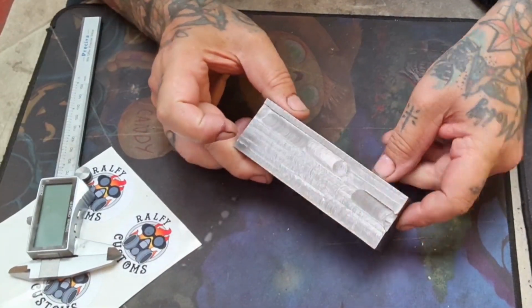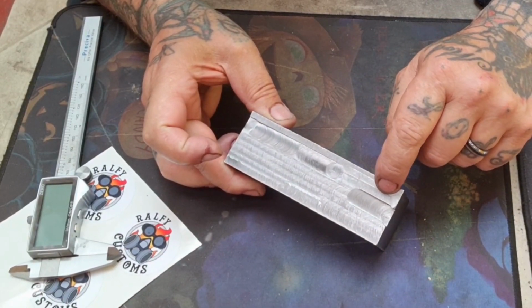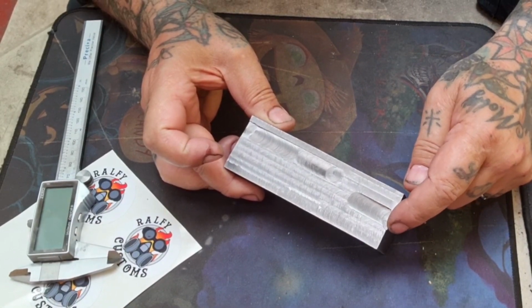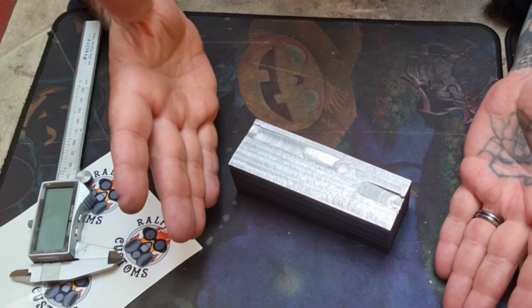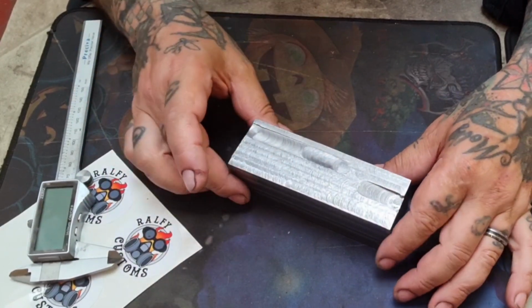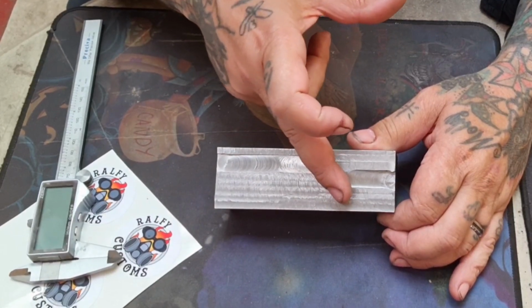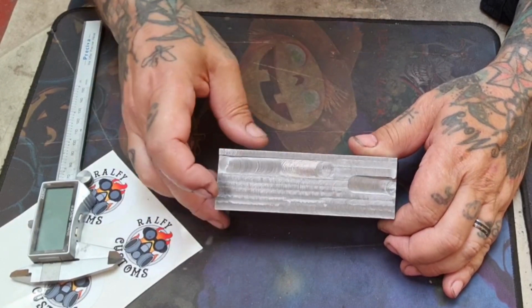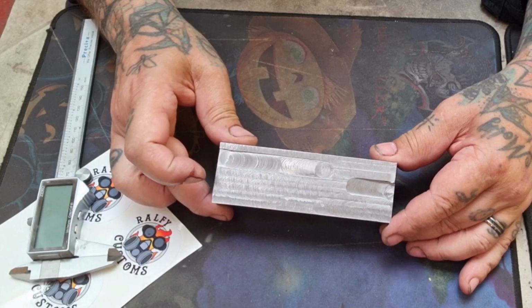Now, I didn't know, but end mills can work their way out of collets if you don't check them between setups. And this one actually ended up taking, instead of a 3mm cut, a 12mm cut. That's never good. But I think we can work our way through this by making this the face that we remove the material off, and this will form the front of our V, if you like. I'll have a go at marking it up and we'll see what I can come up with.